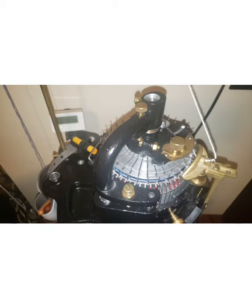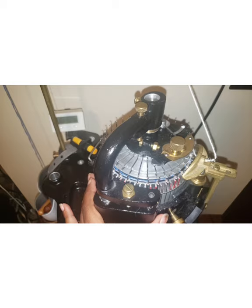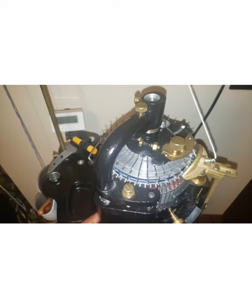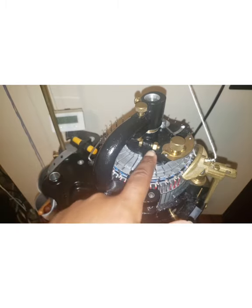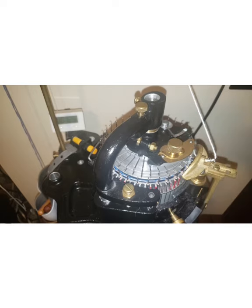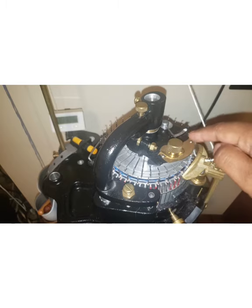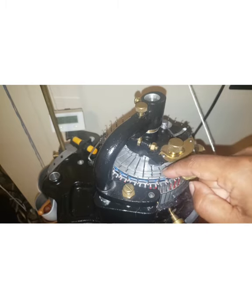First of all, you've got this whole thing called the ribber assembly. This, of course, is the ribber arm, and it is the piece that connects to the actual cylinder body. I think I want to call it the camshell of the machine. And it's actually the cam that rotates here and not the cylinder itself. So as this cam rotates, the arm moves and it pushes the tappet plate, and that's what makes the needles come out. This right here is a tappet plate, and it is the little brain of the ribber. It controls the setting devices for the ribber, and it has its own cams down here, and they move the needles in and out.